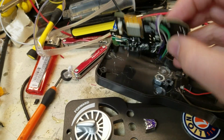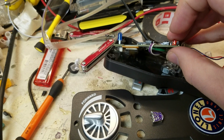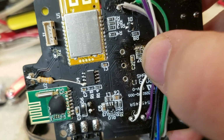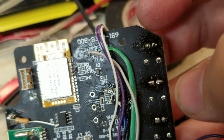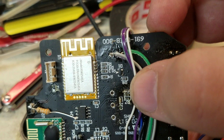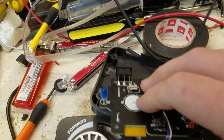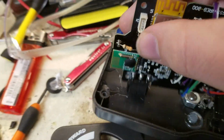Yep, that's everything. Another thing, because I went red, blue, blue, the original 3 orange LEDs, the brightness was incorrect with the different changes, because I know a red LED is going to have a different voltage. So for the blues, I left them alone, and then for the red LED, if you look right down there, it's upside down, but that R3 correlates to this one right here, and then R6 goes to this LED, and then that bottom one is the R7, which goes down to here. And so that one way up there, I actually just soldered on a little jumper to give me full voltage for this red, and then the blues use the original resistor. But up here, I wanted the brightness from down here to equal the brightness up here, so I dumbed this one down quite a bit by using this resistor here. And I'm doing the same thing with the red version.